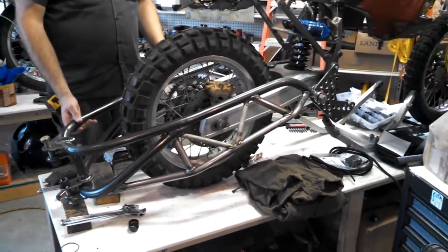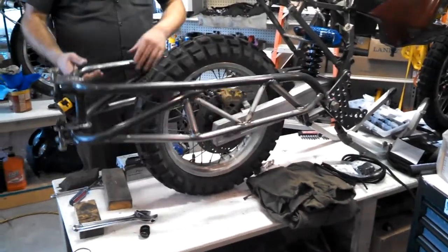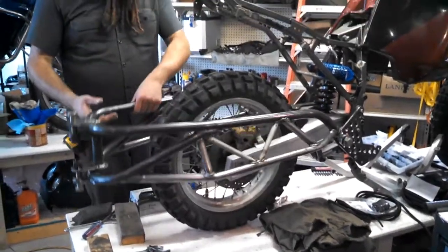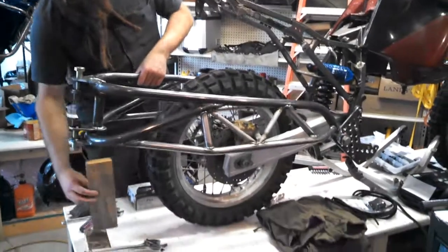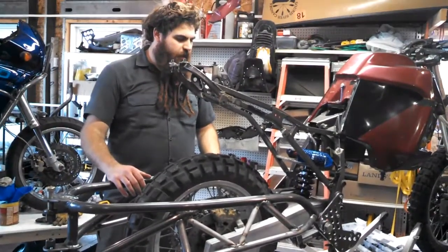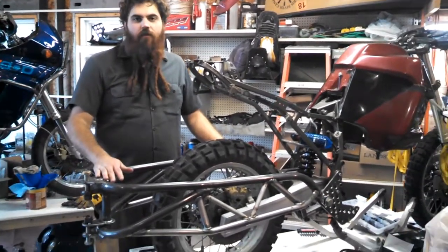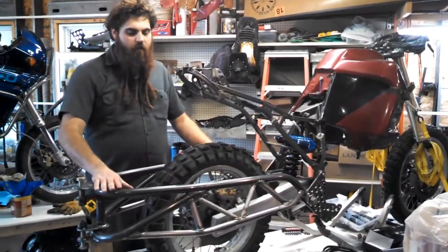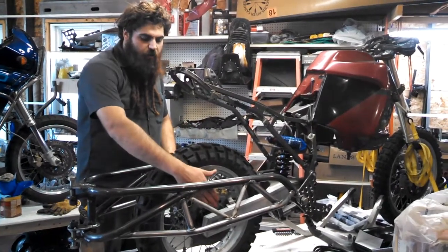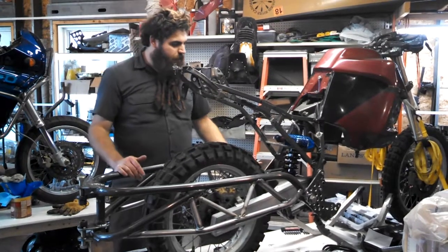It actually goes down a long ways of course, but the table is here. As you're riding along when you're hitting bumps, this whole thing sits like this. I'm calling it the trailer swing arm — this front trailer swing arm is not connected directly to the ground via the axle bolts like a lot of single wheel trailers are. It's connected up here to the frame.